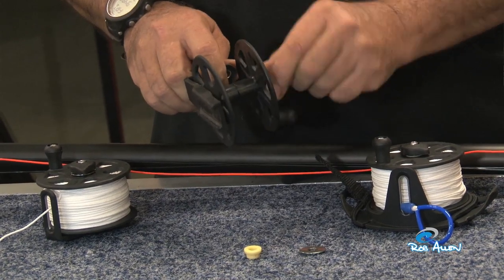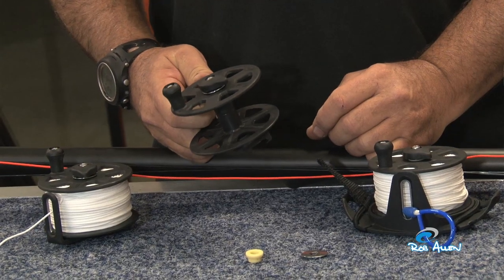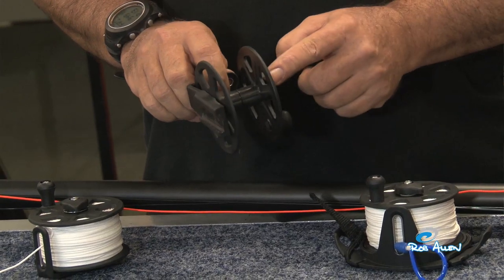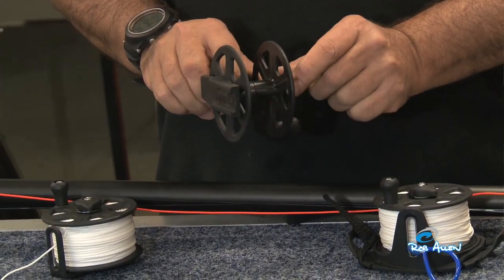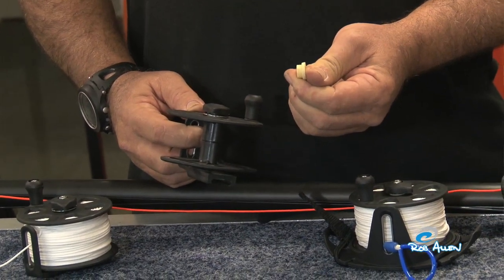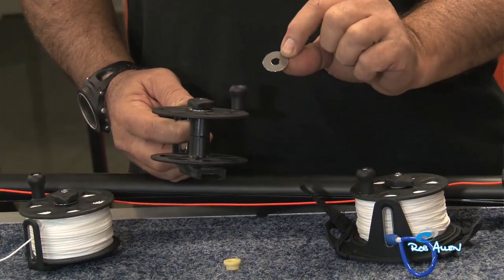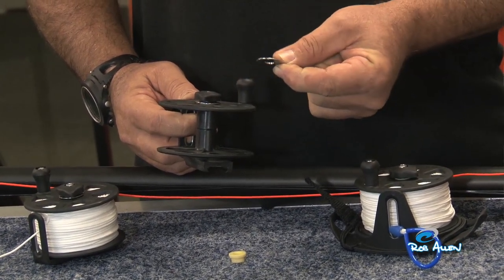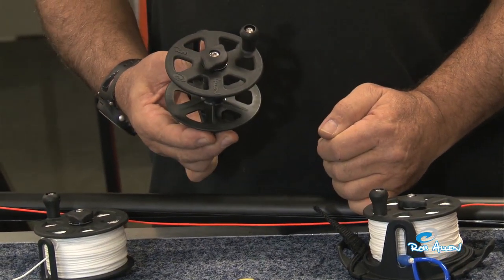The older, smaller style reels can overheat when hunting fast-moving fish. This is because the line coming off at high speed, even though it's underwater, can generate sufficient heat to melt components. We use an acetyl type bush which spins on a stainless shaft. We also use large stainless steel components which help as a heat sink, and doing this has helped with keeping the inner parts cool.